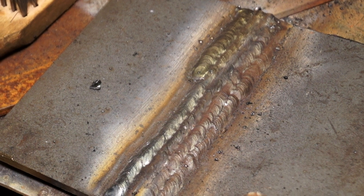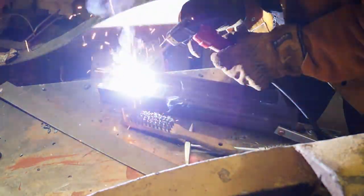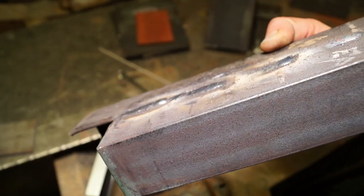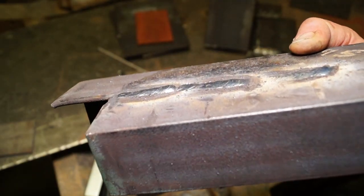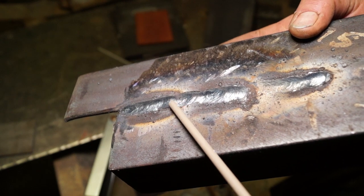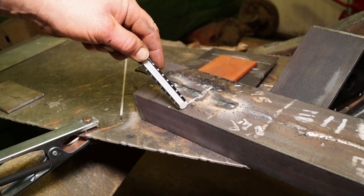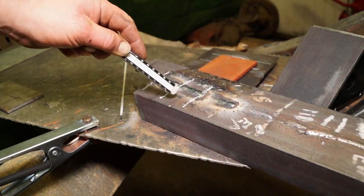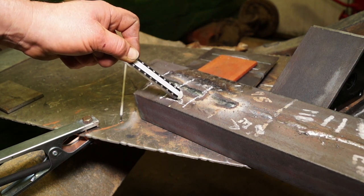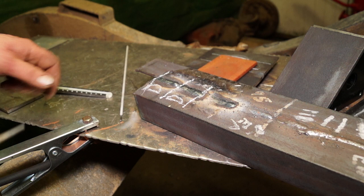In a previous video I suggested that if you're going to practice, first of all on the flat, get some beads laid down, and I suggested there is a certain rod angle for the electrode. I have two slightly different welds here — one's flat and one's more raised. These are two different angles. This one is fairly flat, this one is crowned or a lot higher, and this depends on the angle of the welding rod.